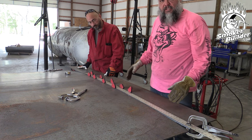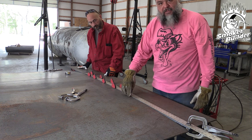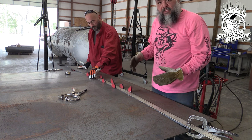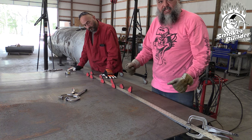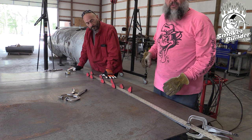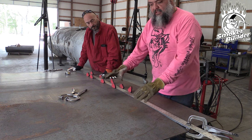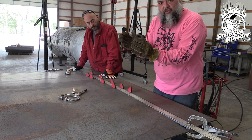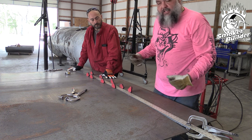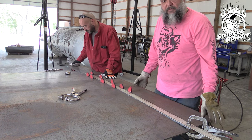The plasma cut is complete. During the cut there were a couple of hiccups where the arc wasn't all the way through. Normally on a small piece I'd go back and address each one, but on a long cut like this, keeping the piece and the stock parallel is more important. Now that we're done, we'll go back and address those small spots, which actually helped keep things aligned.